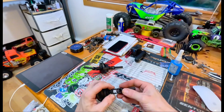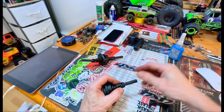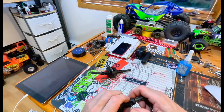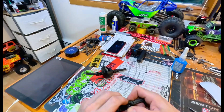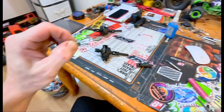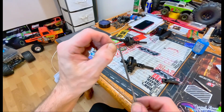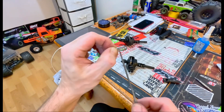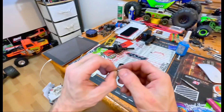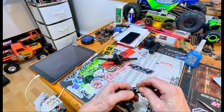Time to put the yokes back on. Slide the two sides together. A couple of mine have extra Loctite in there — kind of gets in there. It's got a little groove, and you can see the little indent — that's where the grub screw sits. The Loctite gets in there, it gets crusty, prevents it from sliding back and forth. Work it back and forth a couple of times to break that Loctite free.